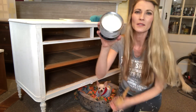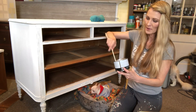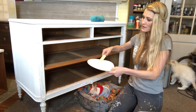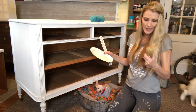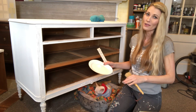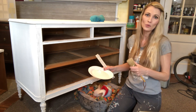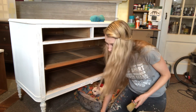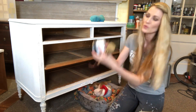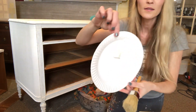I take a paint stirring stick and scoop a little wax out of the container onto the clean paper plate. You don't want to be dipping your brush directly into that container — even if you think your furniture is clean, you'll get remnants of dust or paint color on the brush. If you're waxing a teal piece, the last thing you want is that color bleeding into your clean container of clear wax. Use a paper plate, and seal the container back up as soon as you're done.